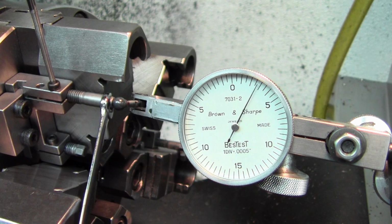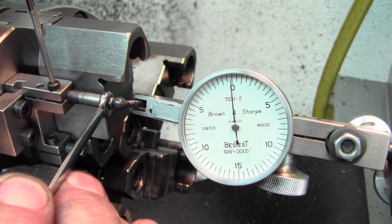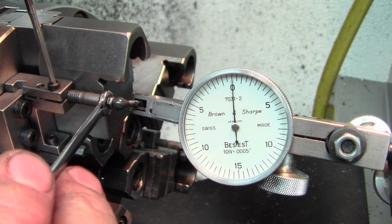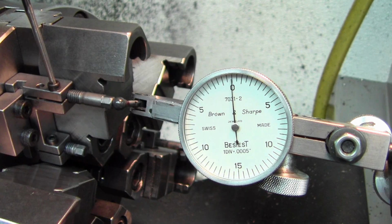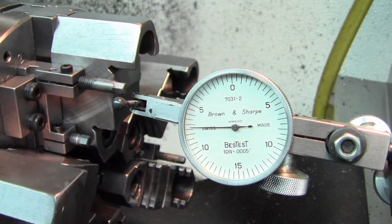Actually we'll go past and back up in the direction that we're loading, and we're also increasing the drag on the clamp screw, so we just about almost can't turn it at the end there, so it's good and snug, so when we lock it up it stays put. That's a 5/10, 1/2 thousandths per division indicator there. And so we're good on that one.